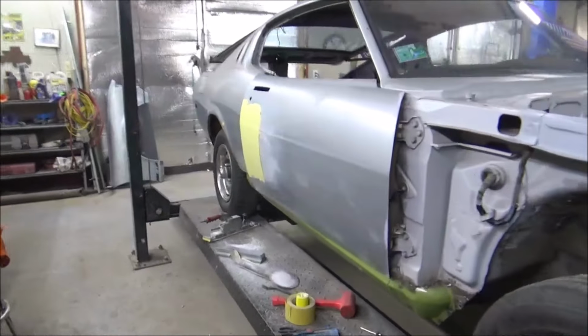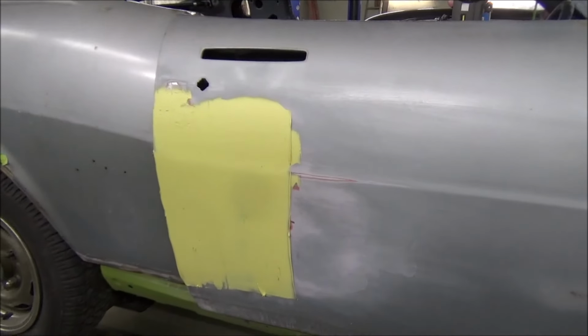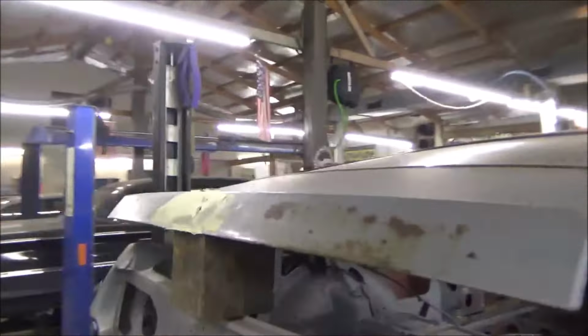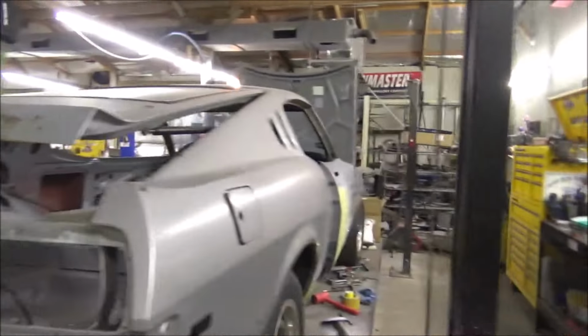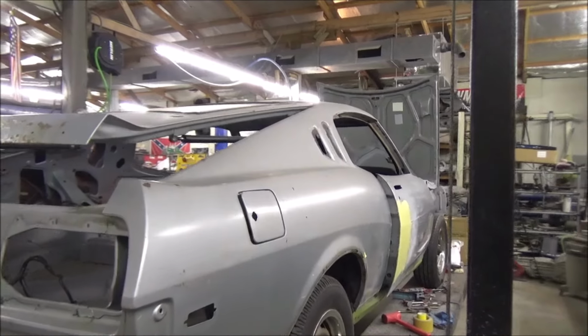Tomorrow. All right. My buddy Jimmy come by throwing me a hand. He got the fiberglass sanded down. So I done a coat of Bondo on there. I had to take care of all the bubbles that were left in the fiberglass. And a lot of them big, deep sanding marks. Got that, and we got that right there. Yeah, so I'm gonna let this cure overnight and maybe come out here tomorrow and block that out. It should be pretty good.